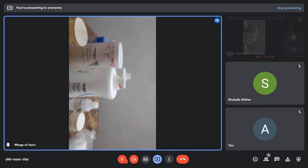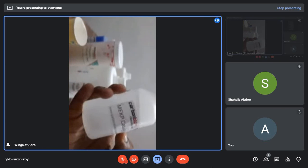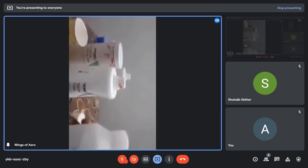Next, in chemical reactions we add a catalyst to accelerate the reaction. Here we use the MEKP catalyst, methyl ethyl ketone peroxide. MEKP is added to polyester resin and vinyl ester resins. As the catalyst mixes with the resin, a chemical reaction occurs, creating heat. Due to this heat, the resin easily cures and gets hardness and stiffness. It also gives good stiffness and strength to the composite material.